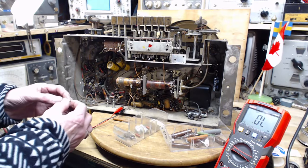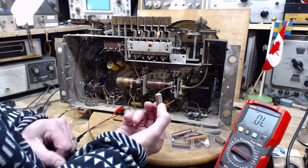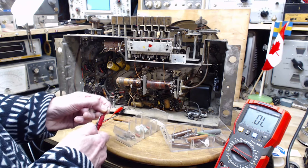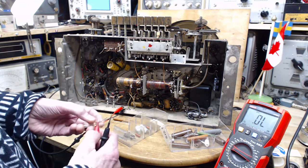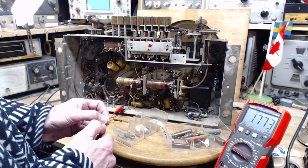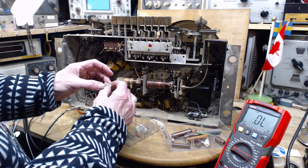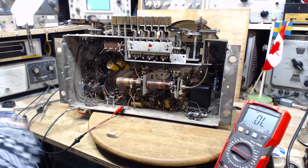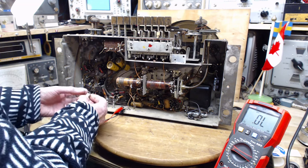And hunt around quite a while to find one here. Here's a resistor, 1800 ohms. Looks like a 5-watt resistor. It doesn't say on it what it is. And the meter says, "1773." Isn't that an important date? That's almost exactly the same then as the field coil. So that'll do just what I'm saying. We'll just divide it all in two here.